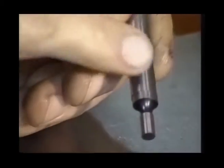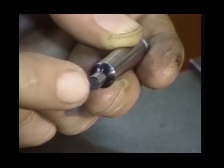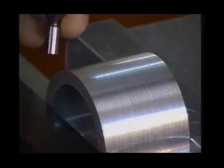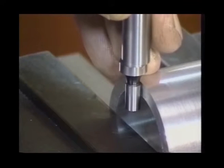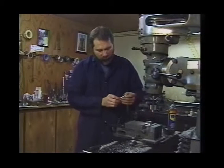These little nubbins on the end are held together in the body by a long extension spring, so as we run it up against the part, it starts running true, and the moment we hit the part you're going to see it jump in an offset mode, indicating contact. The diameter of our edge finder is 200 thousandths — this is usually standard, so always run your dial calipers or micrometer over the end to determine the diameter. At contact we adjust our dial, whether using a digital readout or the X and Y axis dials on the bed.